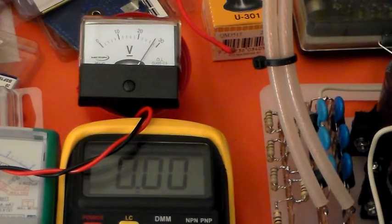there'd be quite a lot of current going into that primary, and those resistors will be pretty unhappy. They'll get extremely hot, and they'll limit the current. Well, for as long as they last, they'll limit the current going into the actual amplifier. So they've got to be switched out. That's why I'm fudging around, switching out resistors that are only dropping the HT line by 30 or 40 volts.